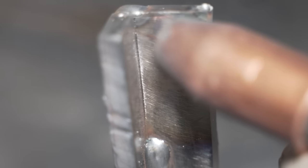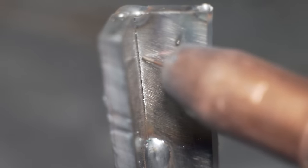And last but not least, vertical down welding. This one drives people nuts. 'Never weld vertical down.' Why? Because. My opinion one final time: if you ensure that you're melting the base metal with the arc before the molten metal covers it, you'll get good penetration and a great-looking weld. But what do I know? I'm just a wannabe YouTube welder.